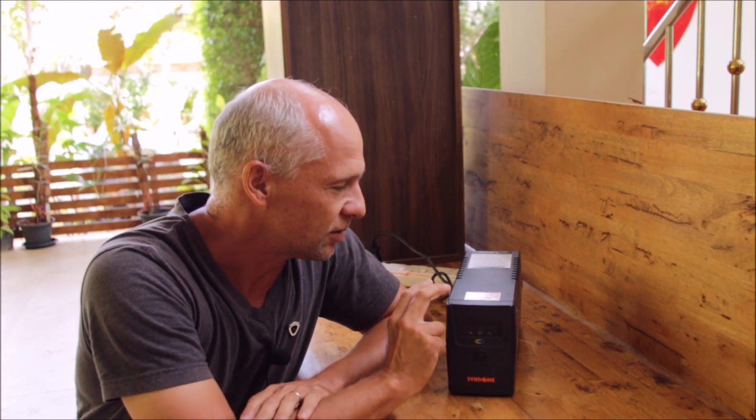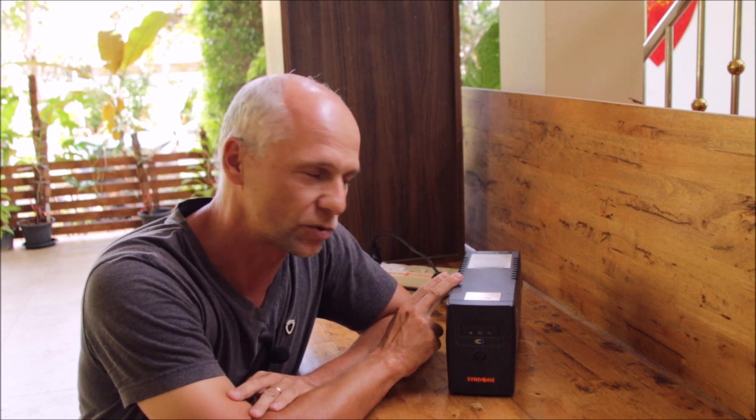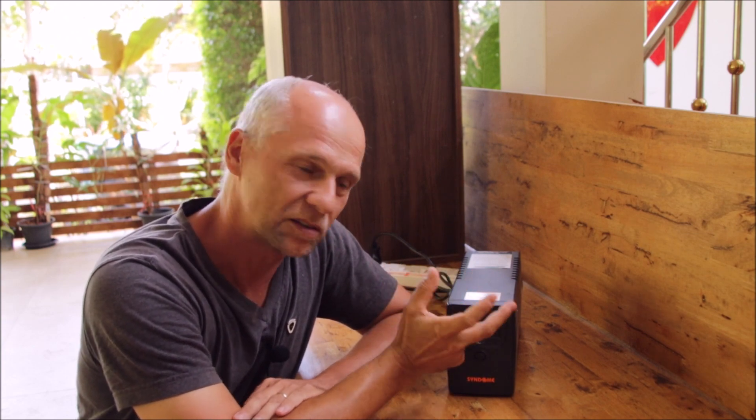This UPS is designed for a lead acid battery. When we use a lead acid battery, we have our control board which is taking over the charging, discharging and everything, and we have only a battery. But after we have rebuilt this to lithium ion phosphate, we now have three components inside: the control board, the battery cells, and the BMS. That BMS in between the control board and the battery cells is what is causing the troubles.